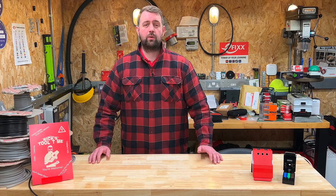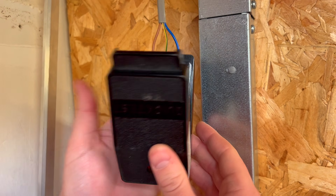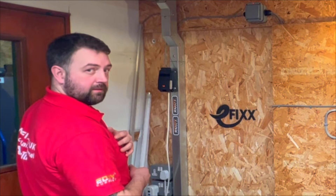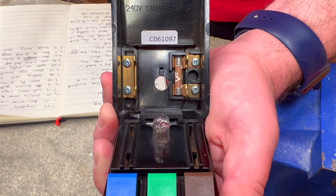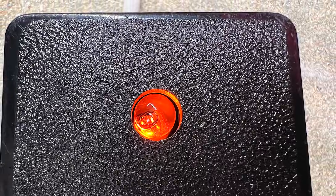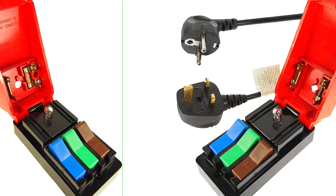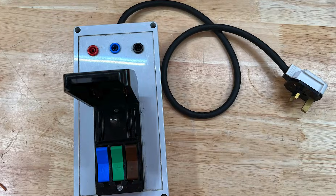We use the QuickTest to power up a variety of fixed electrical equipment such as lights or motors. The lid includes a switch in both the neutral and line conductors, and a UK-style 13 amp fuse in the line conductor. Most variants come with a neon indicator showing that the power supply to the QuickTest is active. Various versions are available with or without a lead fitted.